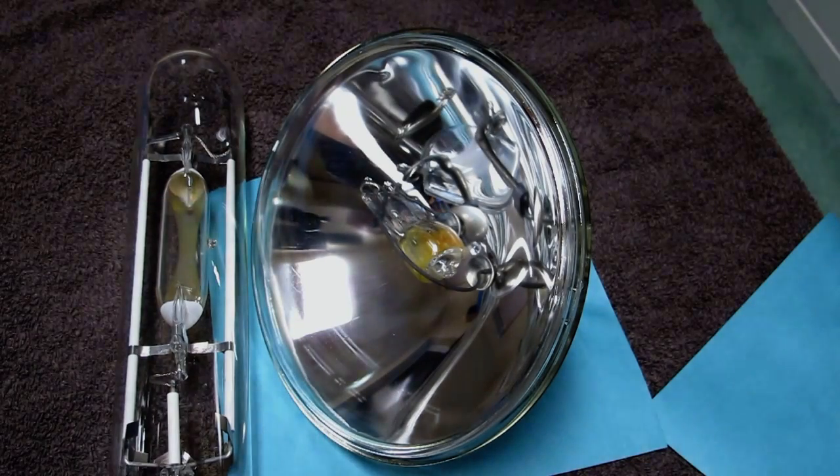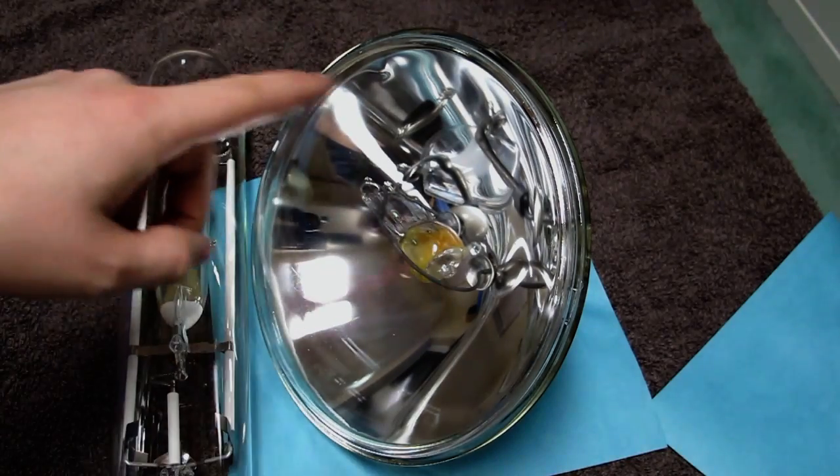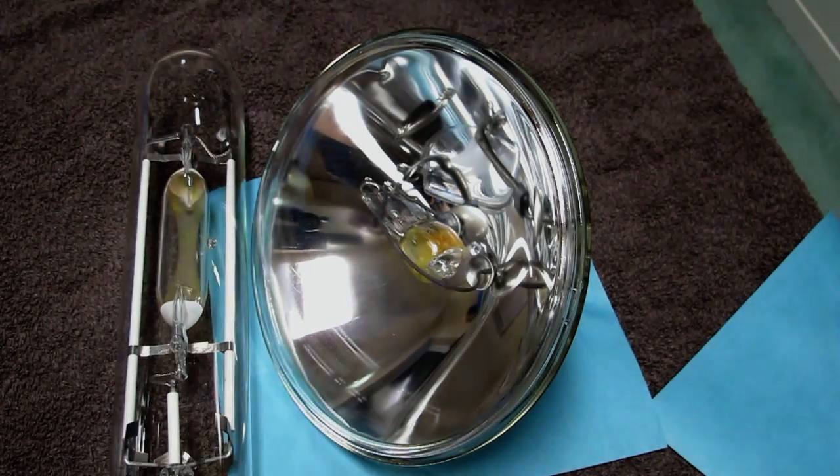Now the lamp itself is only about, I don't know, 78,000 lumens, but because it's in the middle of this so perfectly, the luminous intensity is in the millions of candela, which is why these are popular. Well, they were popular in the 70s and the 80s for lighting football pitches, monuments, castles, flagpoles, whatever. Anywhere where you needed a long throw of lamp, these were your ones to get.